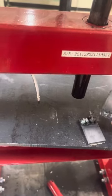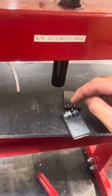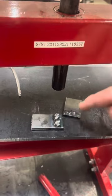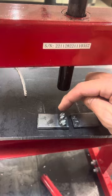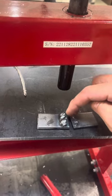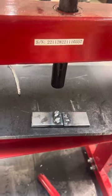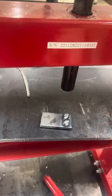See, those are the only pieces that were welded — see that little tip there and that other one. The way to fix this is when you weave, you're gonna try to extend down further on the joint.